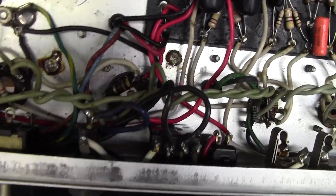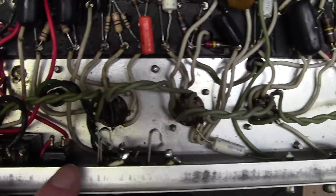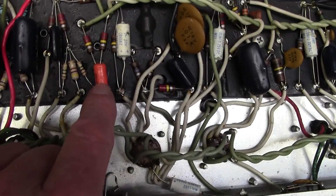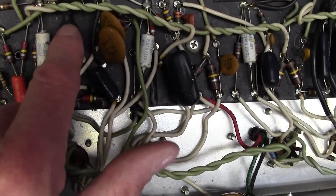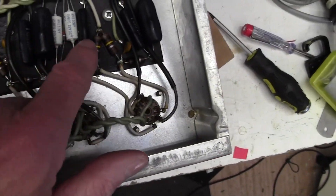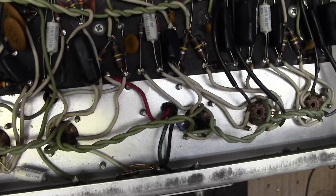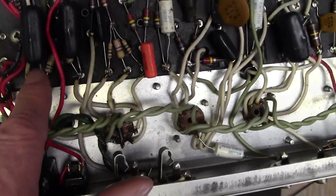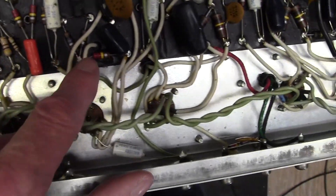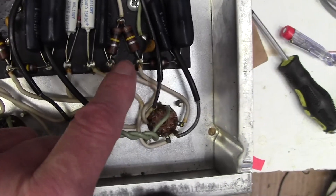All original resistors here, most of them. That one's been changed — that's a new one. There's the tremolo cell; I'll see if that's working — they tend to go faulty and you get a weak tremolo. All of these blue ones are original but they tend to be okay; I try not to change those as they are normally not leaky. It all looks fairly good. I think someone's changed a few resistors — some look non-original. Here are the 100k plate resistors for the preamp valves; I would like to check the value of those.